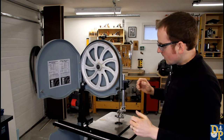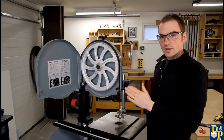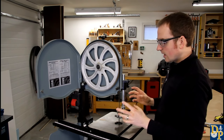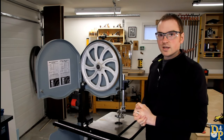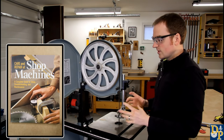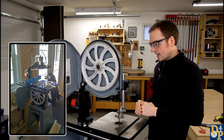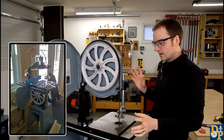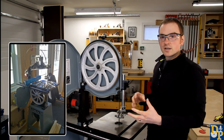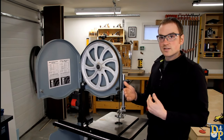Adjust that back and forth until we get it sitting about in the center of the wheel. One thing that makes the tracking process easier is if you set the two wheels to be co-planar with each other - meaning both wheels fall exactly in the same vertical line so one's not out from the other. I would highly recommend a book by John White called Care and Repair of Shop Machines. He goes over that in great detail, as well as really fine-tuning every component of your bandsaw. I did a complete tear down about three years ago - took the frame apart, pulleys off, all the bearings - and it really made a big difference in vibration and accuracy.